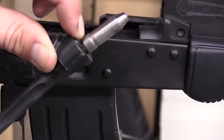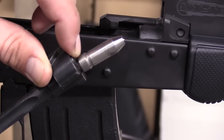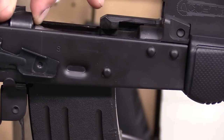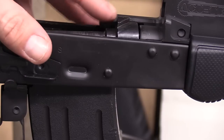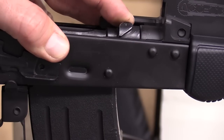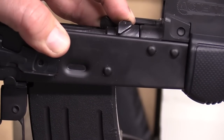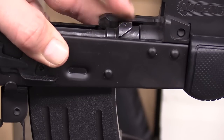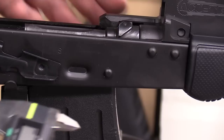No close. Now back to our go gauge on the bolt, now that it's been taken out of the carrier. And we're going to see what the initial measurement looks like for lockup before we go to the die cam test. And now this should rotate over and we should be able to get a measurement. And it looks to me like there is no measurement. It looks to me like that thing is bottoming out on the trunnion. Ideally, we want to see a tight lockup at initial manufacture.